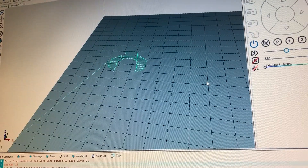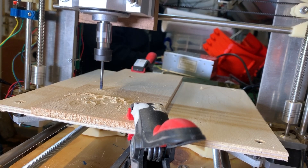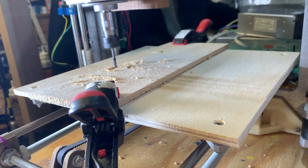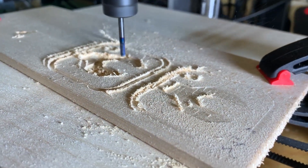It made sense to use a shape I'm familiar with, so I used the Makerspace logo again, but scaled it up a bit so you can see the detail with a 3mm bit — because I didn't have anything smaller at the time. I thought some lime wood would be ideal for the first cuts because it's fairly soft, and I made sure it was a little bit extra secure on the bed this time. Wow — we have a recognisable cut! That's not bad at all.